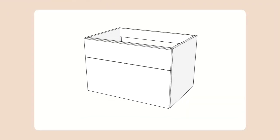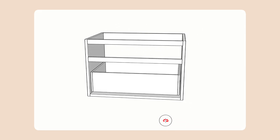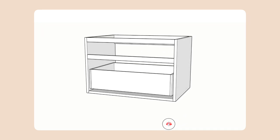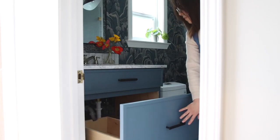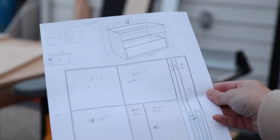Here's the design: it's 30 inches wide, 20 inches tall, and 20 inches deep plus the thickness of the drawer front. I will add a drawer inside to make things more accessible, and on the top I'll also add a tip-out tray just for extra storage.